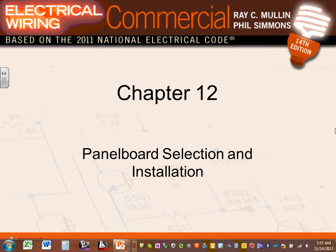We'll finish that. And the second one, guys, is what they call panel boards. Panel boards are either in the wall or on the wall. You can buy them up to 1200 amps, any voltages: 208, 120, 480, 277, 240, up to 1200 amps. After 1200 amps is a lot. So they look like this cabinet against the wall, big boys against the wall. They need a wall to hold them. These are the panel boards. After the panel boards, they move into so-called switchboard and switch gear.